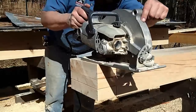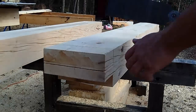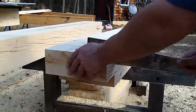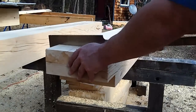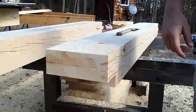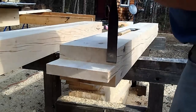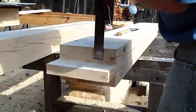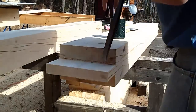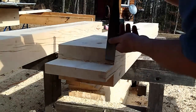And there we are. The last thing to do is just to knock off that block. Sometimes you don't get everything lined up, so I just grabbed my Japanese hand saw and cleaned up the edges. Sometimes you can get it just perfect, but then it leaves a little edge that just needs to be cleaned up. So I'm just going to pound down here with my chisel, clean that up, then pare it nice and smooth. Got to get those corners.